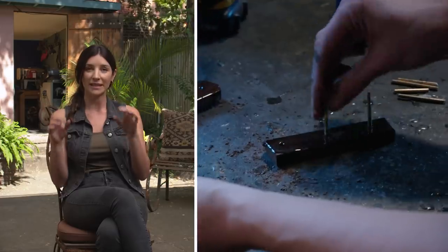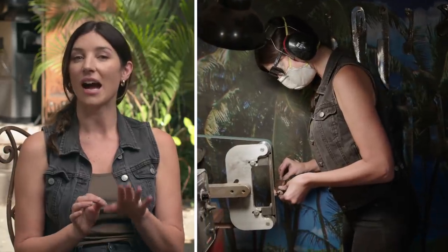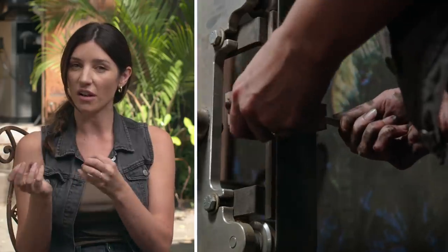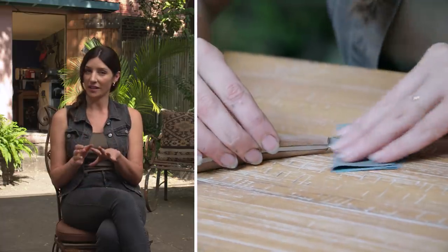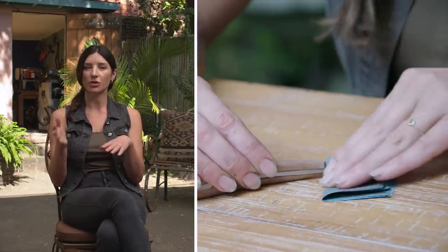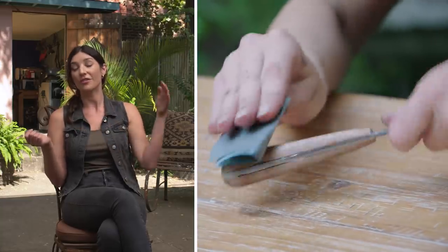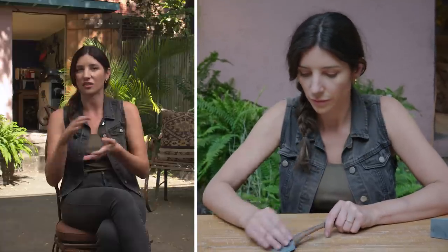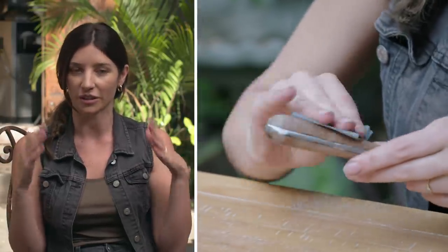Then I'll drill holes for a handle, pins, wood handle, glue it together, clamp it, let it sit overnight, and then starts the sanding process. The difference in sanding this metal butter knife versus the wooden knife is that you're gonna use a difference in pressure — the wood is very soft and the metal is very hard, so you need to use a lot more resistance. In the final hand sanding, you wanna make sure that you use separate pieces of sandpaper, because if you sand the metal material and then move to the handle, you've rubbed bits of metal particles into your wood — which, if you're using a very light colored wood, will get into the grain and look dirty. Separate your sandpaper for the wood and for the handle in the hand sanding process.